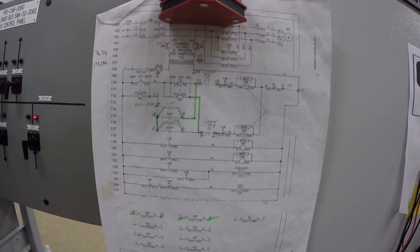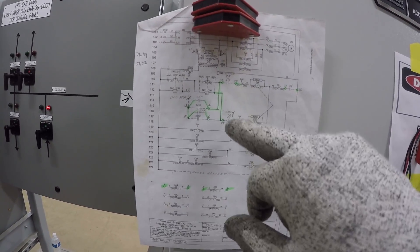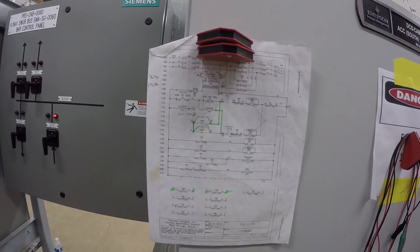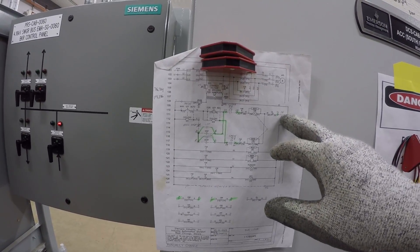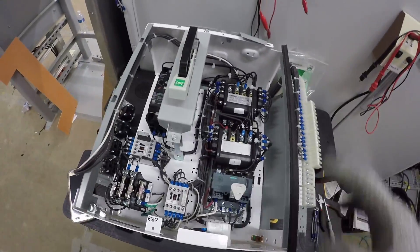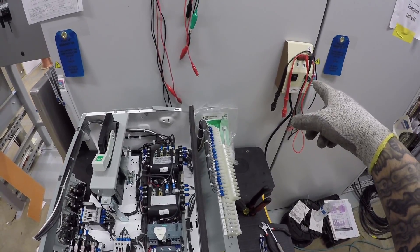This is the circuit that I'm wiring in. They want open contacts there — sealing relays. So I'm basically moving wires around, adding jumpers, and it's going to all work. And I'm testing it too with my suicide box here.